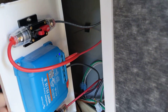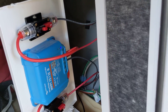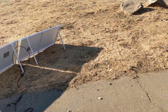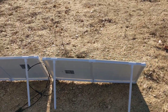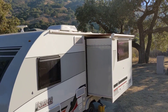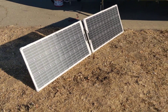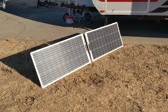I've got 200 watts on the roof and 200 watts on the side panels. Just because I positioned these correctly, my roof panels — both in the sun right now with nothing shading them — are generating only 40 watts, while these side panels are generating 140 watts. Same size panels, but just a bit of positioning gives you a lot more output.